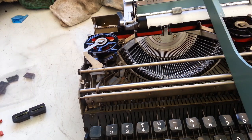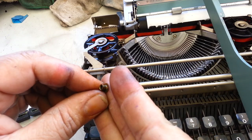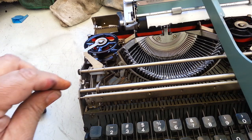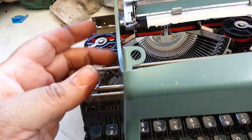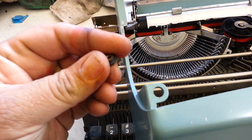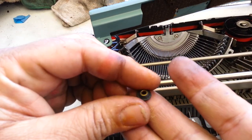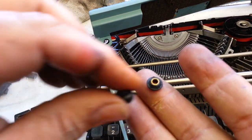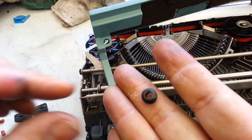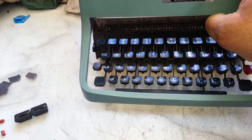I made some little pieces. They had this little piece, and there was a rubber grommet custom fit for it that would go on this little stud that goes in the bottom of this and sticks through. I ended up making these little replacement pieces right here out of a grommet. So that's already cut. I made them out of this piece right there, and I'm going to show the process for this one right here on camera. I only have one left to do.